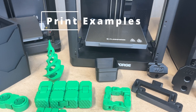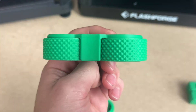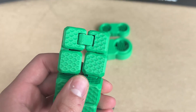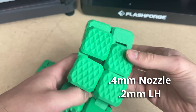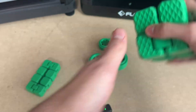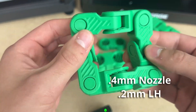Let's get into a few more print examples. On the 0.4mm 5M, I made, for the first time ever, some fidget toys. I've always been focused on functional parts, so it was actually pretty fun to make items like the double fidget wheel, a fidget cube, and an infinity chain. These models were printed with green Bambu PLA and sliced with the standard PLA profile on Orca FlashForge. These fidget toys require good bed adhesion and decently tight tolerances. The small models came out great, and I simply scaled them up to get larger versions, which printed nicely too. However, the fidget cube requires some bridging, so one of the floating connections on the 200% fidget cube fell off during printing — yet the print finished and the part still functions well regardless. The fidget chain printed pretty well, but there were comments on Maker World about the extreme overhangs being really difficult for any machine. The rounded edges and completely floating sections warped a little, but the chain is still satisfying to use.